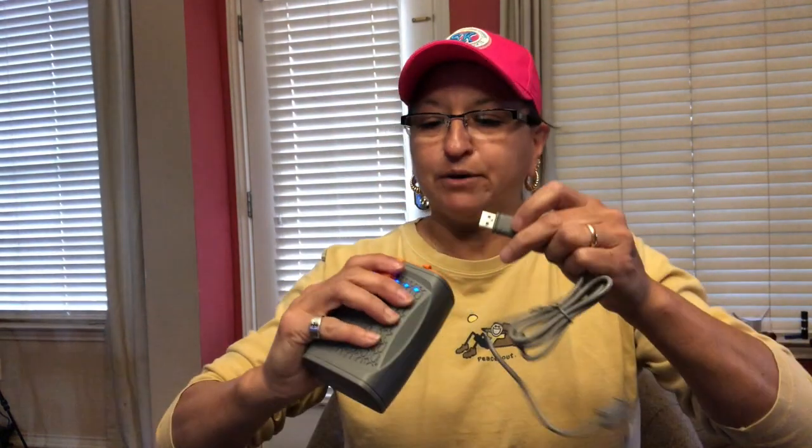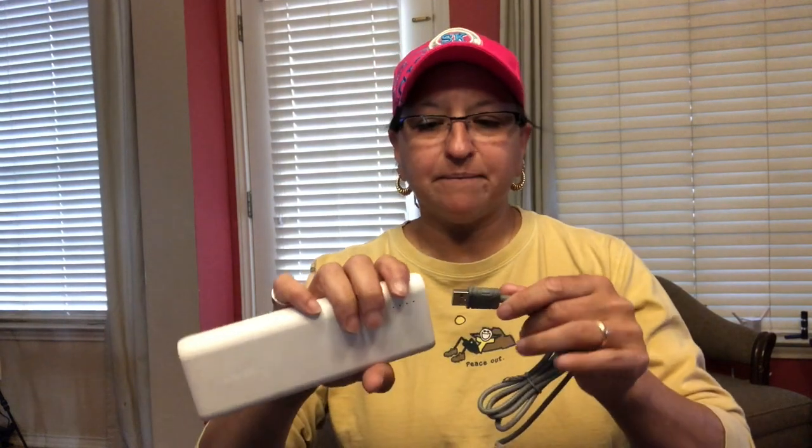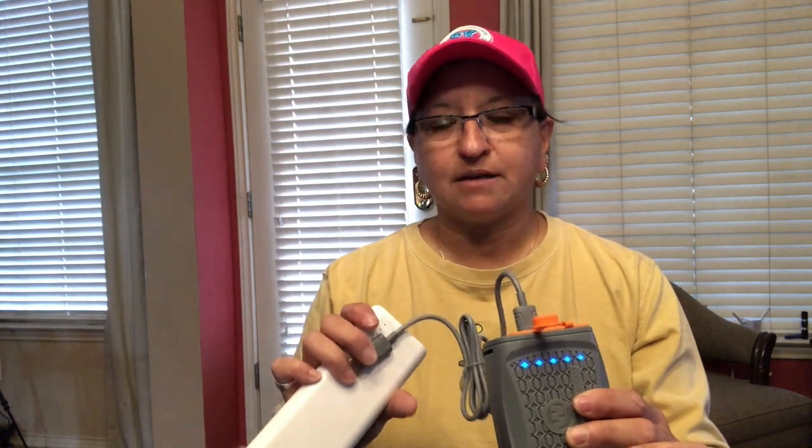So while the Wilderness battery was still running the fish finder and blinking on its last 10%, I put the micro USB into the battery's input port, connected it to the Anker charger, and started charging. But what happened was — as soon as I plugged the Anker in, the fish finder turned off. So it seems like you can't run anything while this battery is charging.